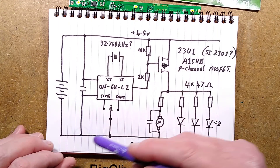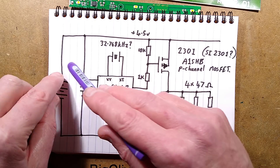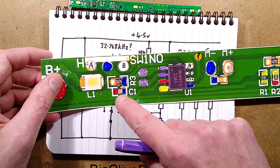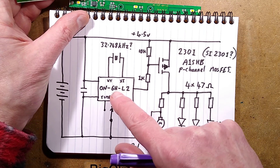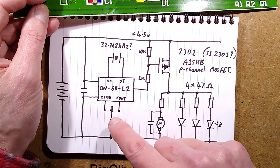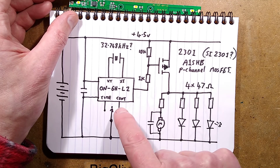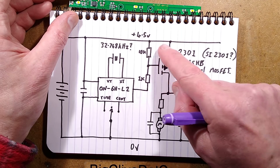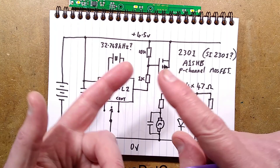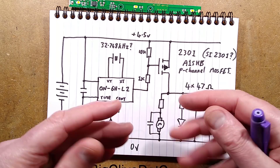Here are the batteries. There is also the option of plugging in the jack - when you plug in the jack it breaks the positive so that you can't reverse charge into the batteries, and it powers directly from the jack. There's a little decoupling capacitor across the supply rails, and then to the microcontroller or dedicated chip with its crystal and the little switch - when you switch it to either timed or continuous. This microcontroller, as soon as you put the batteries in, is powered all the time. All it does is indicate which mode it's in by pulling one of these lines down to the zero volt rail. When it does that, it will either drive the MOSFET continuously or do that six-hour timing, then turn the MOSFET off for 18 hours. The reason they've chosen six hours on and 18 hours off is because it's binary - that's one in four for the six hours on.